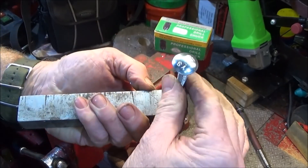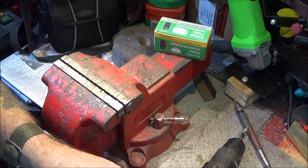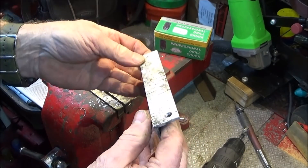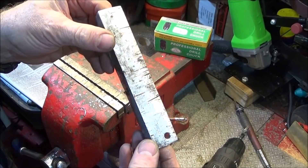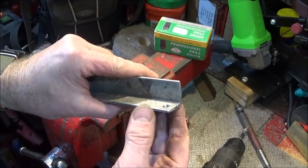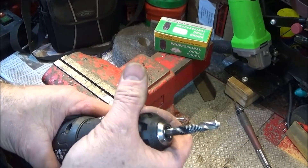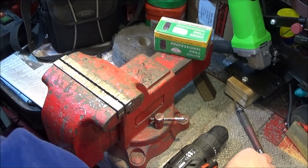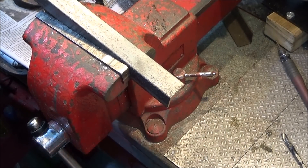A perfect thread. That's actually a great tool for doing fast work. If you're bolting together something like angle aluminium or angle iron you could use those drill combination taps to do many threaded holes quickly. I think that's a great little tool to have and like I say you can buy them individually or in sets.